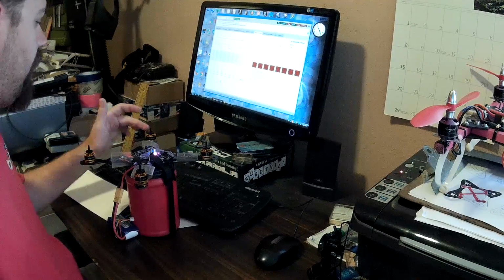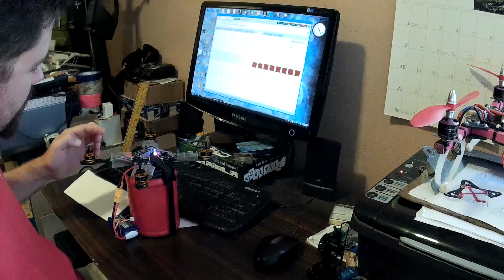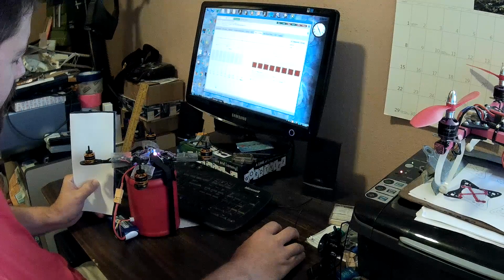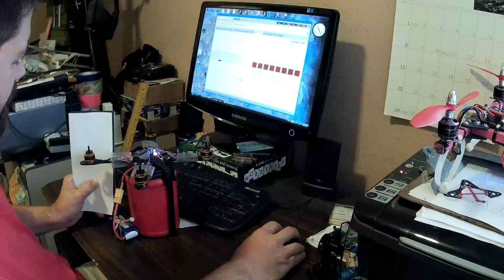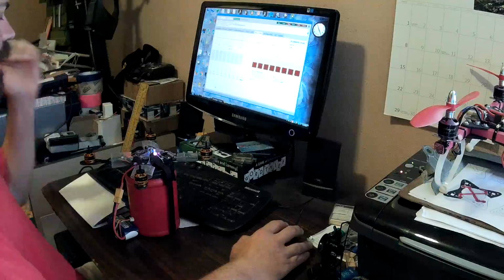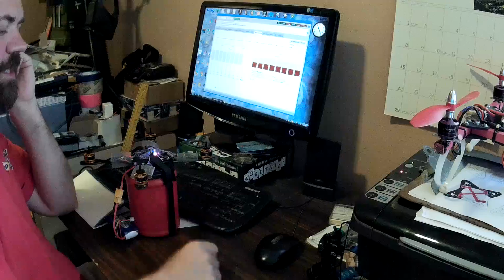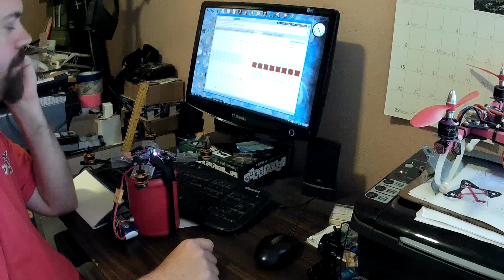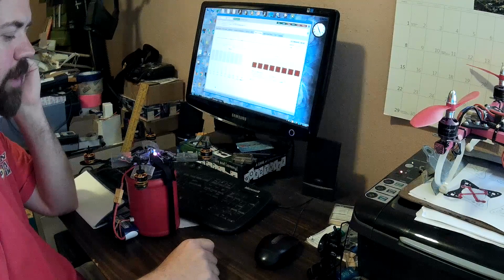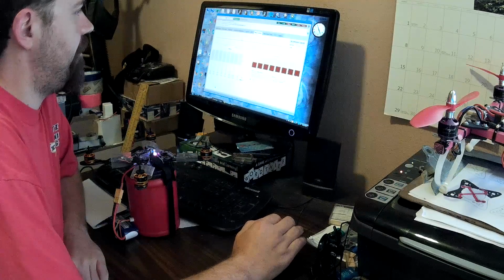So, I'm going to swap that motor, and I don't know. Maybe the shaft on this one may be just a little out, maybe not, but I definitely think that doesn't look too bad. It sounded funny for a second there, though, I thought. But definitely the nuts I'm going to replace with just nylocks. I just need to grab the calipers and measure these and see what they actually are. I think they're M3, but I'm not sure. So, hopefully, after that, we'll fly a little better.